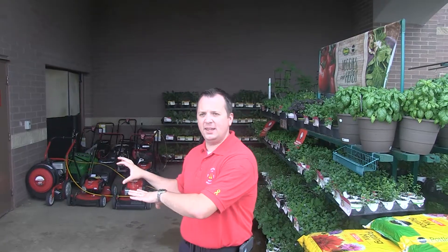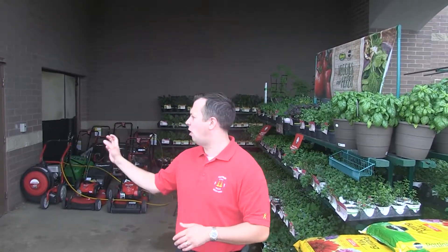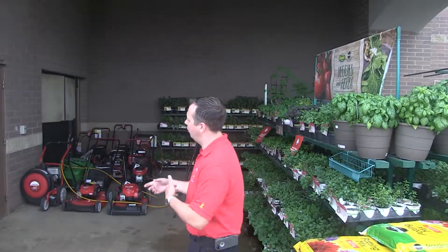We're here at Lowe's to talk about sprinkler systems. We picked Lowe's because it's the biggest system we have in town. It has five wet risers, two dry risers, and a fire pump, so we can show you every component there is — how to shut down a wet system, how to shut down a dry system, jockey pumps, air compressors, and a fire pump. If you understand this system, you can understand every system we have here in town.